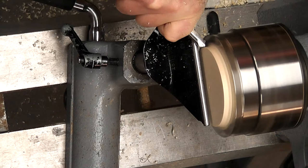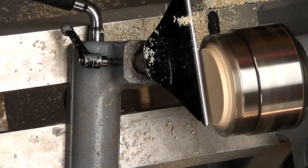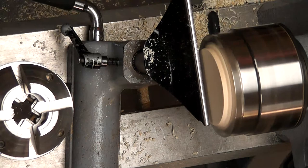Just taking away that uneven edge, just whilst I can on this surface. Now, it doesn't have to be dished at all, because we're going to put a recess in there. So that doesn't really make a huge amount of difference. I'm going to just size my chuck now, and just bring that into camera. I just want to close that down to 6 mil gap.